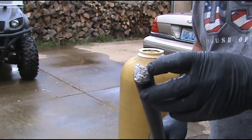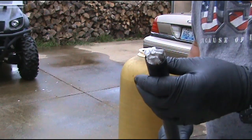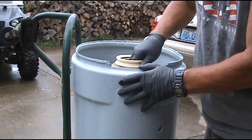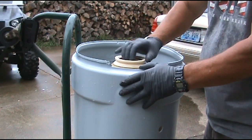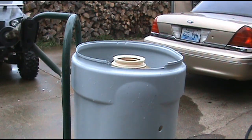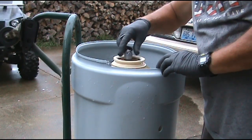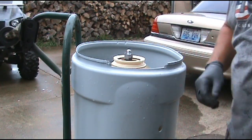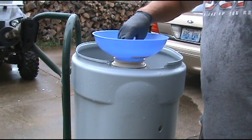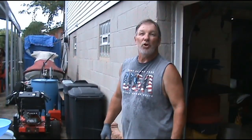I'll put a piece of paper towel down in here for extra precaution to keep anything from getting in there, and I'm still going to put duct tape over this. Now you want to take your resin tank and put it inside your softener before you fill it with resin. There's an indentation in here that holds it in place so you can't make a mistake. Put the tube down in there — there's a place at the bottom for it too — and you can feel it seat in the center. Then take your funnel and put it in.